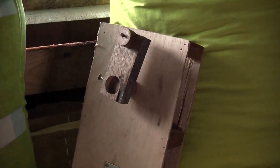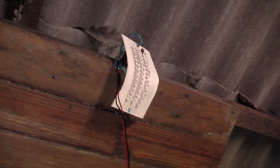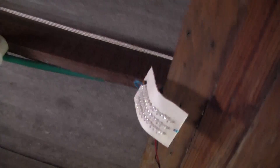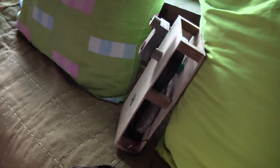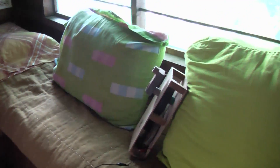Conclusions after the first night of use: the hand generator connected to a cell phone battery and up to 50 LEDs was a great success. The whole setup was like having a bedside lamp more or less — it lit the room with about that intensity. The one improvement I would probably make is to put a switch on it, because about a minute's cranking was giving me well over an hour's worth of light, and eventually I had to disconnect it so I could actually get to sleep.